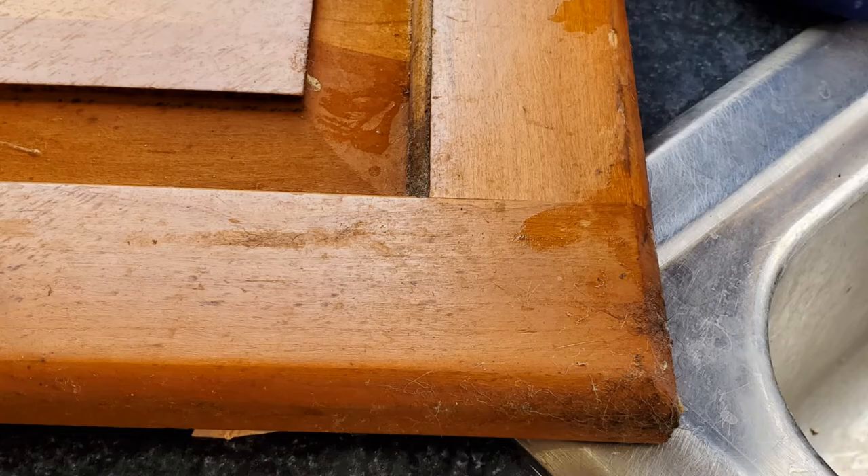Kitchen cabinets are very dirty. They usually tend to have a lot of oil, grease, grime, and oils from your fingers. It might not be visible to the eye — trust me, it's there. So you want to thoroughly clean them. If you skip this process and don't do this thoroughly, chances are the adhesion of your paint later on is going to fail. You might end up with spots that will flake and chip off very easily.